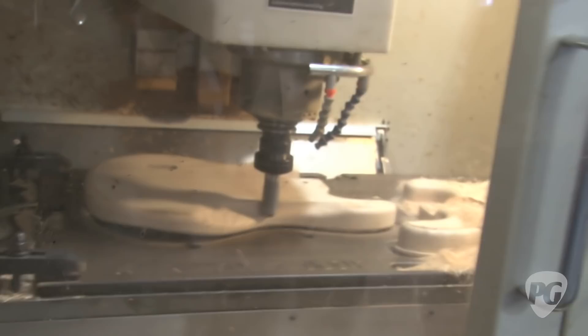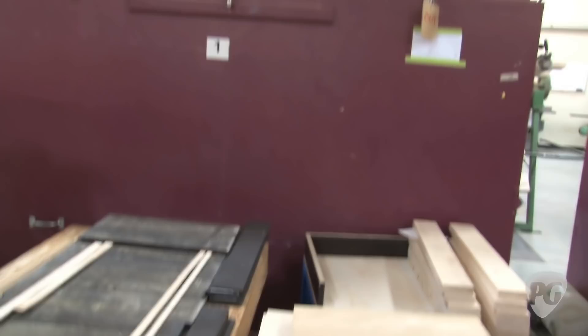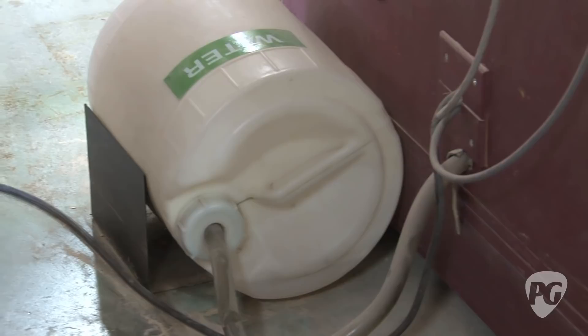We buy already treated and dried wood. These are two kilns here. You see fret boards going in. Get a shot of that tank right there — that's water that's come out of what is supposed to already be dry wood. So you see we bake the guitars in the hot box because we don't want them shrinking or expanding. We make sure that we get them good and dry here. We don't take the mill's word for it, and you can tell by all the water that's in there.